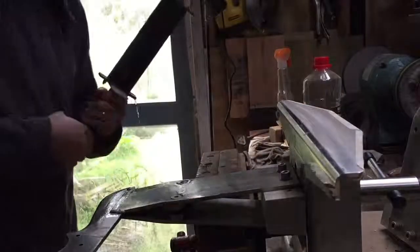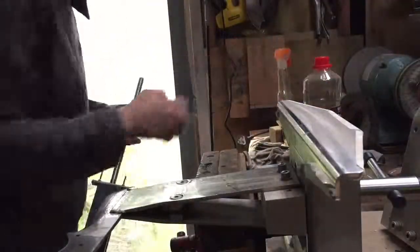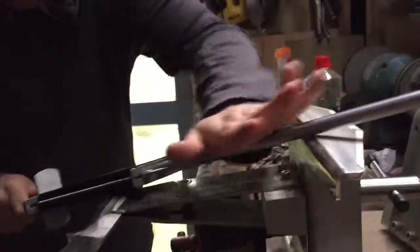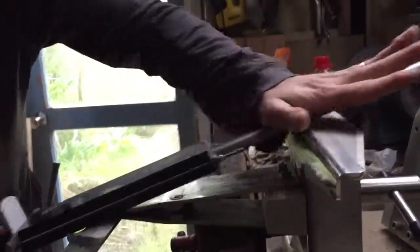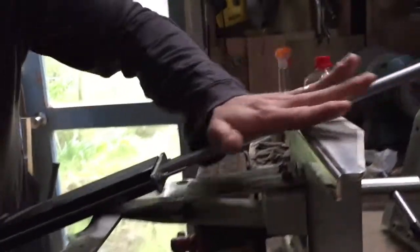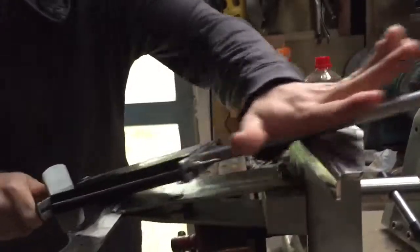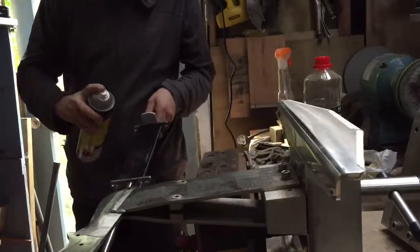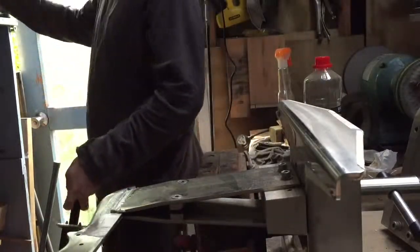This shelf that I'm rotating holds the thing into something like 1/4,000th of an inch accuracy, so it doesn't really rotate once it's locked in. It's in there nicely and it's not going away anywhere. So here's a bit of noise you can hear as we just grunt away and remove a little bit more metal. The finer the stone, the harder the stone, the less metal you're taking away. See what that's like. I've got to do a couple of the knives today, so just give this clean off. Hang it back, and then we'll test how sharp we're getting this.